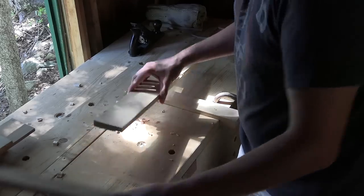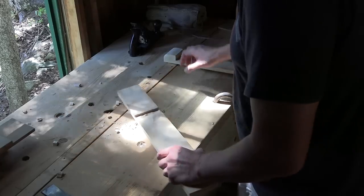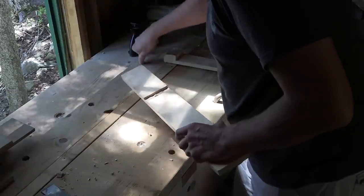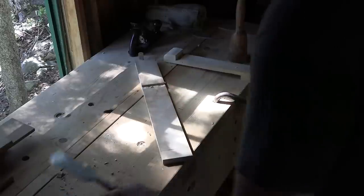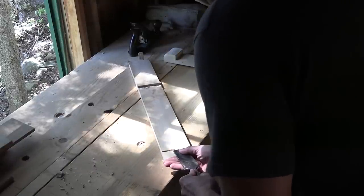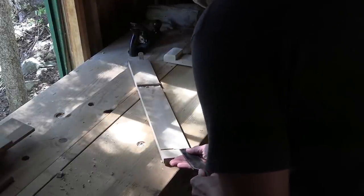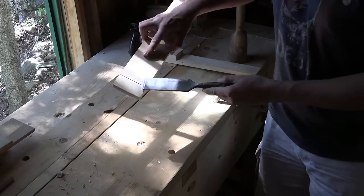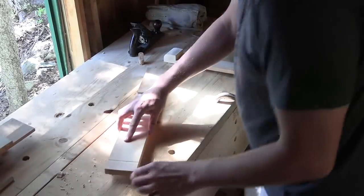A lot of times what I like to do is embrace that direction of force idea. And let's just take a peg, stick it in a hole in the back, and now I can work directly into that peg. Let's clear the gunk out of the way first. And now I've got a little bit more controlled method for creating that knife wall just by working straight into a peg.